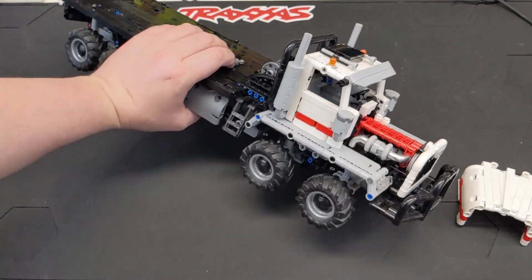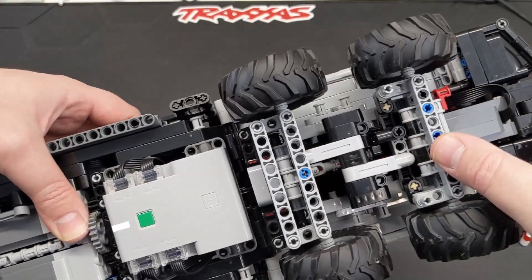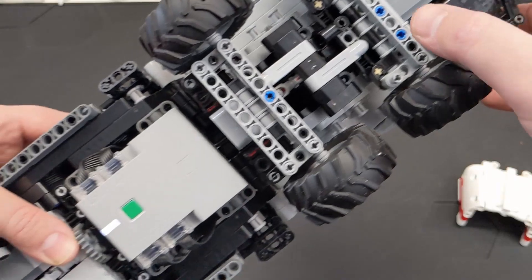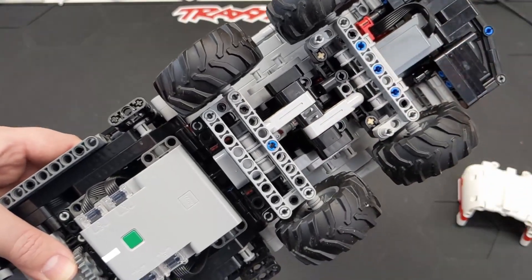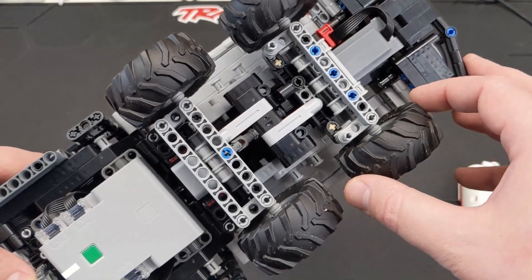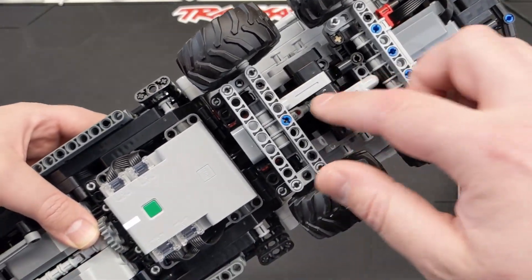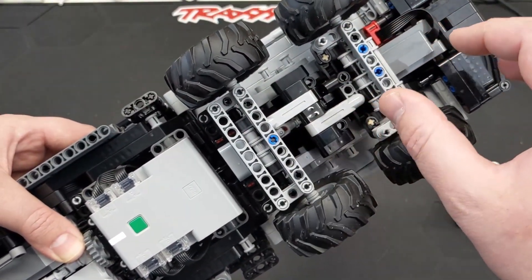I screwed up. When I first built this, I didn't get the steering lined up correctly. What you want to do is get your motor set to like 90 degrees, straight up and down, and then set your gears in line with that as you go to make sure everything's lined up. I don't know what I did because I knew to do that, but I guess I didn't. So these were lined up with each other but they weren't centered with the motor. So whenever I would calibrate, it would calibrate off every time. So I had to kind of slowly, carefully take all this apart and rebuild it, which is an absolute pain.